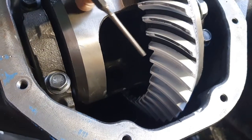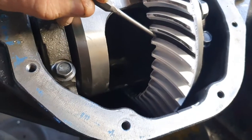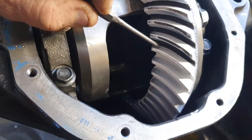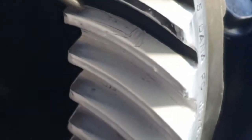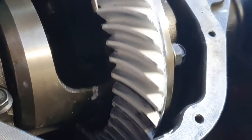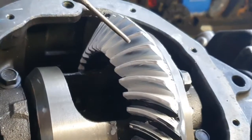It should be — the desired mark should be up around like that, a long broadish mark going up about from there to there. It will most likely have a growling at this crown and pinion. Look at the mark there — it's got a broadish sort of mark here.